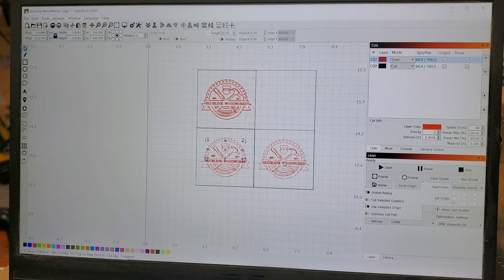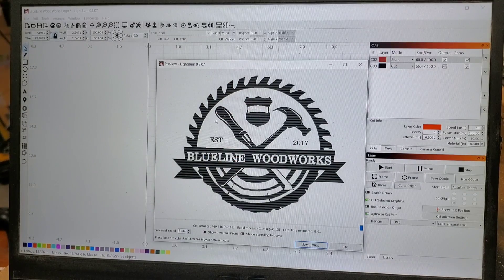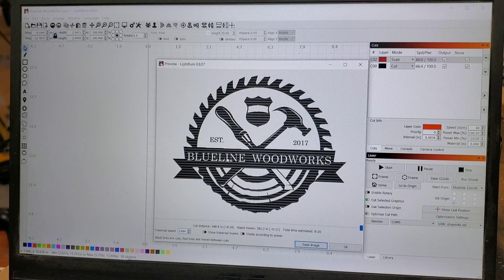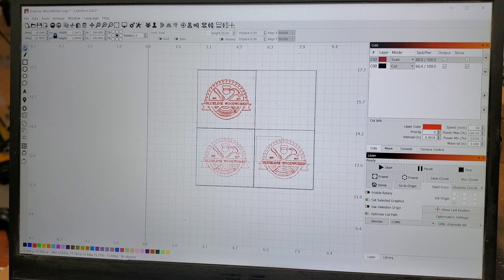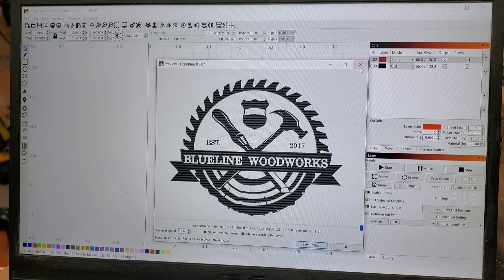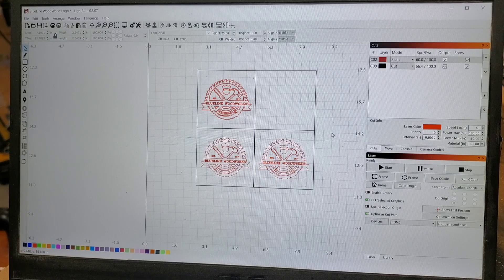When I did the logo in the bottom right, I used the exact same settings but I turned the over scanning off. Because when I engraved the others with over scanning on, the letters were too small and you couldn't really see them. With the exact same settings — 60 inches per minute at 100% power with the 4.2 watt laser, one pass — but over scanning off, it turned out really nice. I'll show you the final result and this will be a wrap.